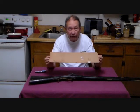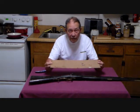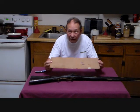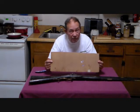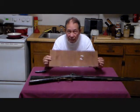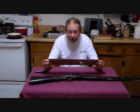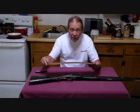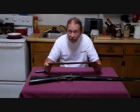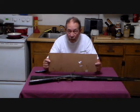We have taken our wood and cut it to a more convenient shape. As it turns out, this is a very thin plywood, produced in a country where there was plenty of wood but they did not have the wherewithal to make an expensive mill for corrugated paper. It is much less expensive to make a mill to take a veneer and bond it into plywood. But it is fragile and tends to split at the edges. So the first thing I'm going to do is put a coat of finish on it to firm up the wood and give it more strength, so we can make cleaner cuts — and then use the plastic template to cut our wooden patch box cover.